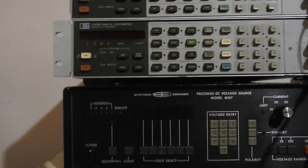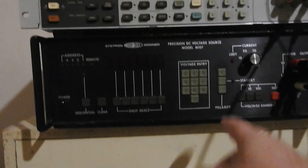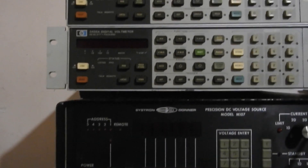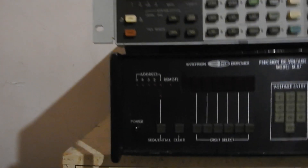I've been running these two HP3456A voltmeters against a DC voltage source, just seeing how they drift and how well they track it, trying to get an idea of the accuracy of all of them. I've had it running for a few days, and these were within the last one count of each other — at two volts within one count, at five volts within about four counts.